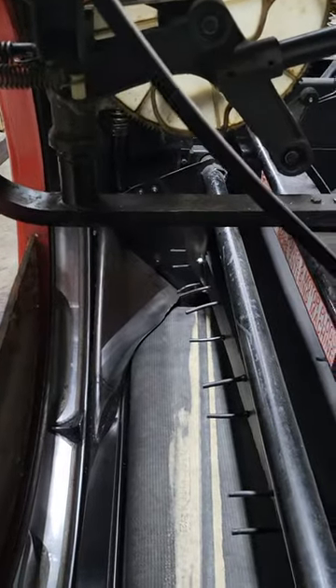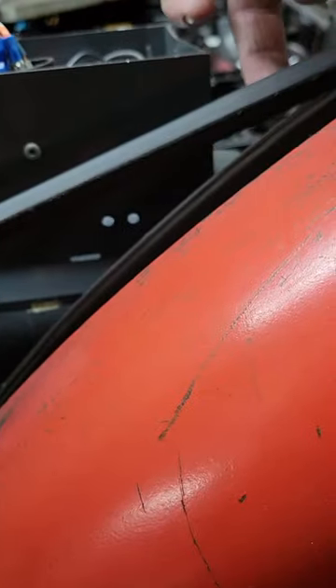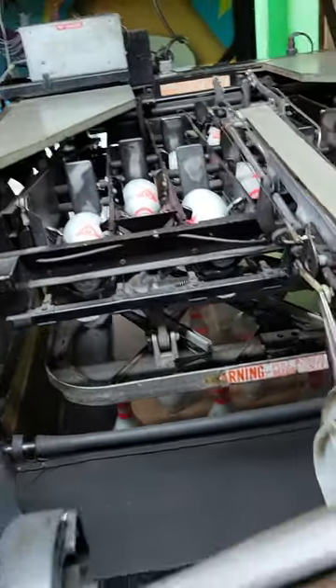Once your belt is hanging in this area, always leave your belt right here. Take a pry bar and pry along the channel until you get it up underneath the pinwheel and resting in these grooves. Then come back over to this side, get it in and around that pulley. Take a pry bar, slide it up underneath here, pull this way. Once this is in, leave your pry bar there, move over to the next one, pry up and over to get it to pop in, then play leapfrog with your pry bars until the belt is on.